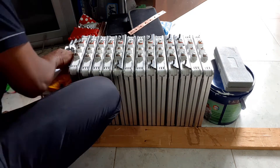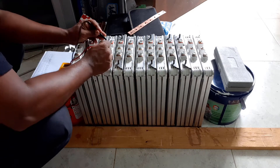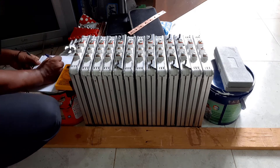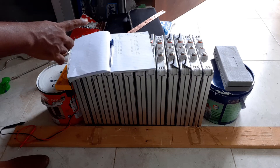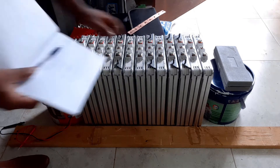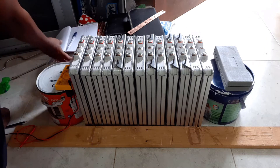Write down your initial voltages. After you record them, we have to connect all positive wires together, all negative wires together, and all the middle wires together using bus bars. Be careful not to short circuit your modules.